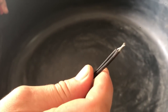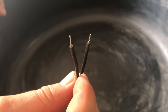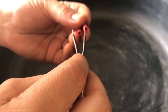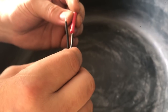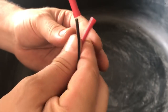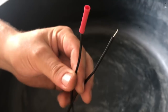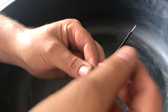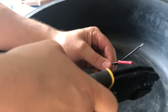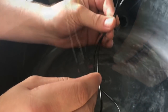We need to extend this cable, and we'll use some utility wire — the same gray wire we use for the solenoids. We're going to join that with the water level sensor switch wires using butt connectors. Put the butt connector over one end, then take the cut utility wire end and use crimpers to get a good crimp, crushing the wires together.